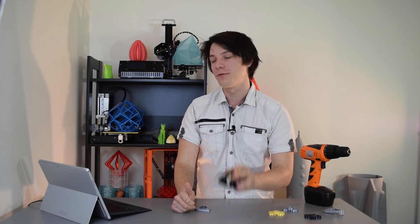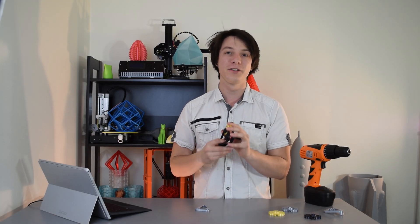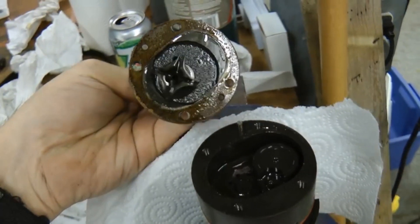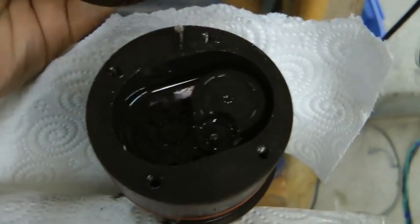Because of this, Geneva Drives are known to wear out very fast. However, similar to cams in your engine, you can protect them using oil. In fact, film projectors used to encase the entire mechanism in an enclosure full of oil so it was always coated to help prevent overheating and undue wear.